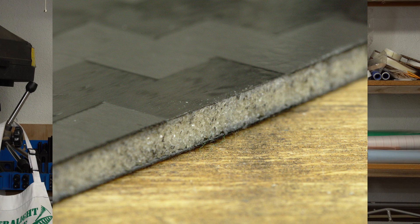Another thing I learned that makes a lot of sense: when you have a sandwich with a foam core and a cut-off edge — I'll give you a close-up view — what you want to do is make sure that you wrap that edge with a little bit of carbon fiber. It doesn't have to be a whole lot, but you want to make sure that neither one of the faces can peel off your core. Even if you tab a fuselage bulkhead up to its skin, if you haven't wrapped that edge, you can still get some delamination from your core.